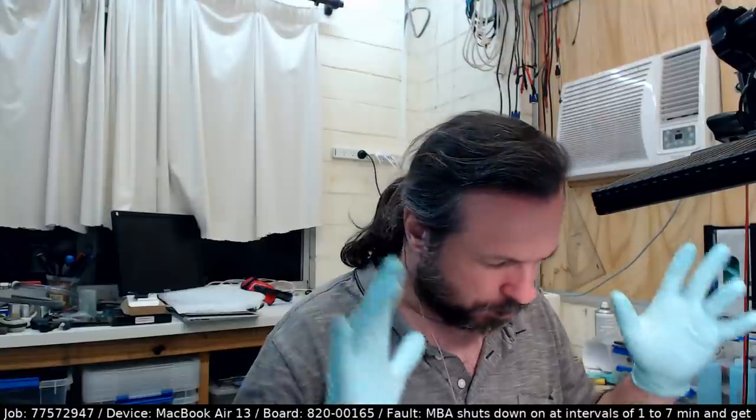And I'm still fighting with the drivers for the infrared software. I'm trying to decide what I'm going to do about it. If any of you out there are competent with writing USB drivers, like WinUSB in this case, we need to modify WinUSB or have an INF file set up so that it can handle the FLIR One Pro composite device. The other person I've been having assist has been using a tool, Zadig or something like that, but it doesn't quite make it work yet. So it's a bit of a pain. And that's on Windows. Then there's macOS, which is a whole other problem. I'm using libusb, which should work, but the problem is that bit in the middle.